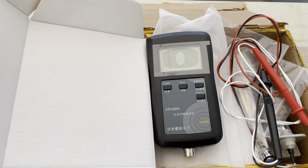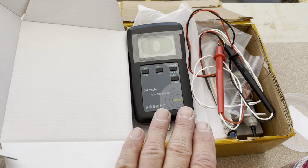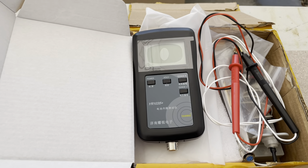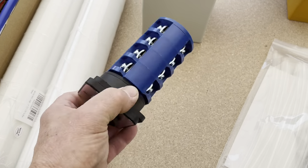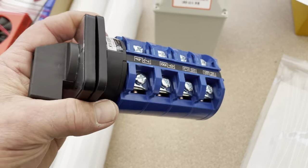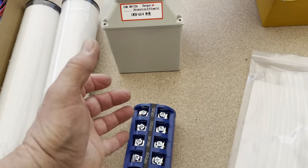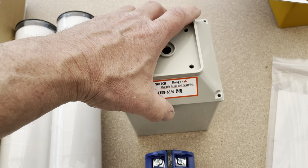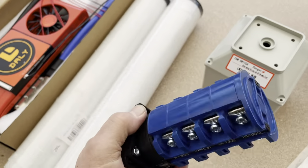We have this little internal resistance meter — really nice, with cute little double-probe leads. You've got to use this before you hook your batteries up. If you have any bus bars or anything on those terminals, your readings will be worthless. I also found a neat little transfer switch on Amazon — couldn't resist it for 30 bucks. Each contact is rated at 62 amps. I'm not going to be pushing that, but I can always double things up to get more current through it. The box was supposed to come with hardware as shown in the Amazon picture, but it doesn't.